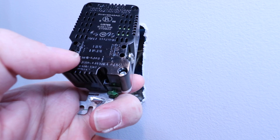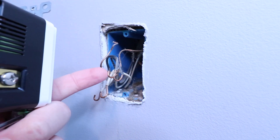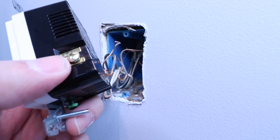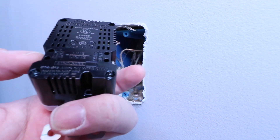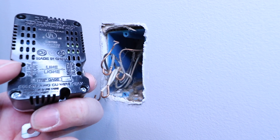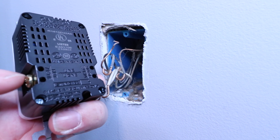Our hot wire is the black wire — that is the wire with incoming power — and the white wire is our neutral wire that we're going to put on these terminals. We've got two sets of wires here: two black hot wires and two white neutral wires. On the back, we've only got one terminal on each side. So we're going to backwire this — we straighten the wires out and put them inside these little terminals so that we can have both wires connected to the terminal, rather than looping around the screws since we don't have two of those to connect to.